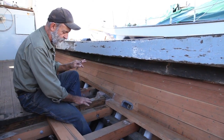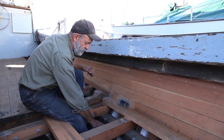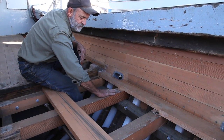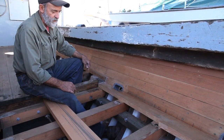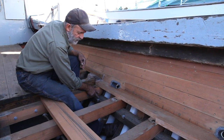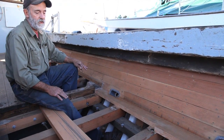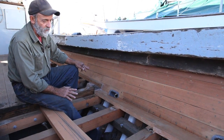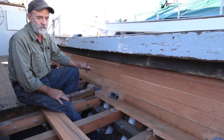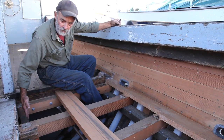Where I'm sitting here, you can see there's a transition in the deck — this is an upper deck forward and this deck is a little bit lower. We've also replaced the stringer that the deck timbers sit on, because this was the problem with the boat to begin with. This timber was not much of a timber — it was fastened only to the wood frames with a couple of screws, and it had come loose the length of the boat. So the deck and the sides of the boat were no longer connected, which is why all the deck water would end up in the bilge and you're constantly pumping it out.